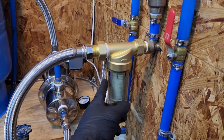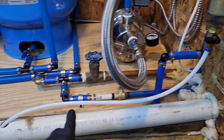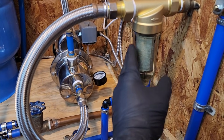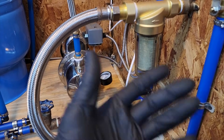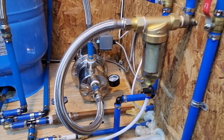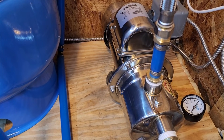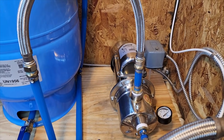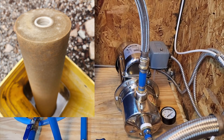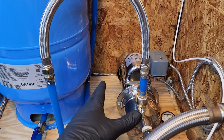There's a check valve here, and this is a spin-down filter — you can clean it out just by giving it a little dump and all the sediment in the bottom gets flushed down into a pipe connected to my washing machine drain that runs outside. You can take the pressure off the system or take the filter apart to clean off big sediment — leaves, pine needles, or large debris, though there rarely ever is any. That's our first line of defense, and it runs over through flex hoses to our one-horsepower stainless steel shallow well jet pump.